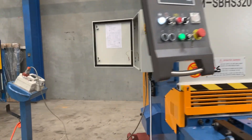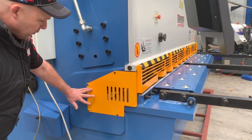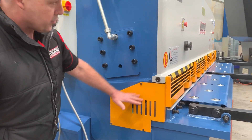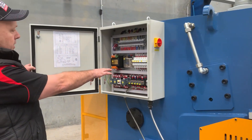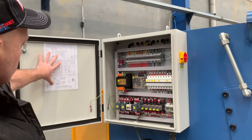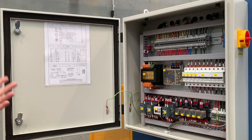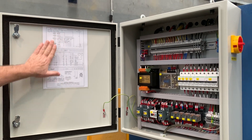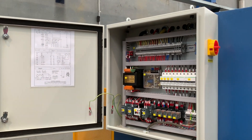Running around the side of the machine, we've got a 250mm side throat. You can take that side throat off and slip material through the side — 250mm deep. As you can see with the electrics, everything including your schematics is on the inside there, so in years down the track if there's a small issue, a sparky or contractor can look at the laminated schematic and fix it up.